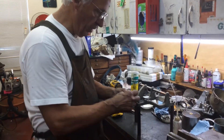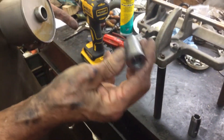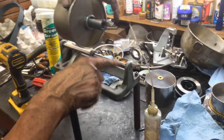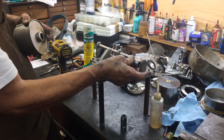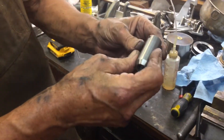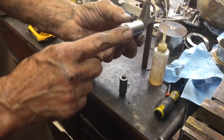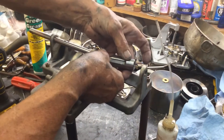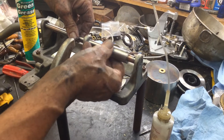Here's a prime example of what you need to look at. These coupler thingies go into the spring barrel like this, and then the screw here connects here, and that all holds together — that's what makes everything spin and turn. Here's one after I've cleaned it up and polished out this bearing piece here, and cleaned all this up too, because this goes into the spring barrel but it runs right here. So if you slide this out, slide this in, and it hooks up like that.